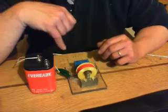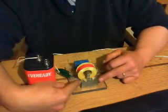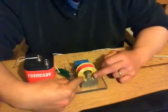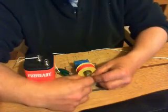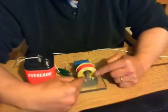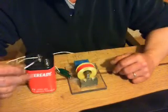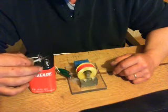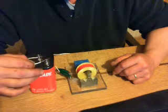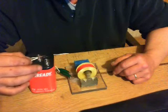The negative's already connected, and the positive is just lying off to one side for a moment. This is another laminate steel block, and on top of it I've got two N42 magnets — they're 1cm by 0.2 — and they're facing north-south, so they're in opposite polarities. If I take the positive and just touch it to the positive, we get a considerable deflection going on there.